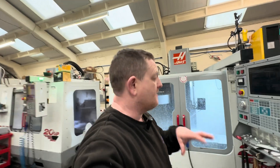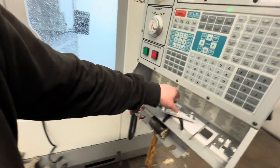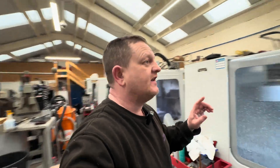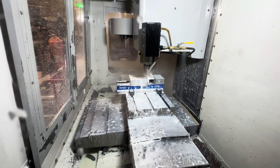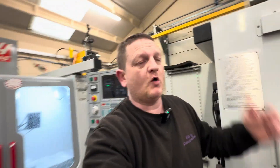I'm actually machining a batch of parts today — making these small brackets on this machine. I've just done one and I've got another nine more to do. It's currently roughing out with a 10mm tool at 6500rpm, 2000mm a minute. Chopping away nicely.